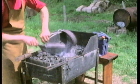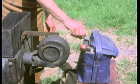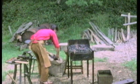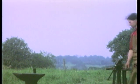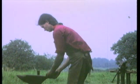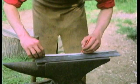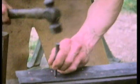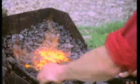This forge I made for shoeing horses while in London. It's powered with a 12-volt battery and a blower from a Morris 1000. These are the steel straps from which I will make the brackets for the center deck beams. Each strap needs several large holes, and it's much easier for us to punch them in the red-hot steel than to drill them.